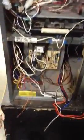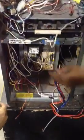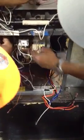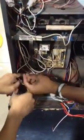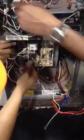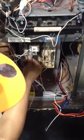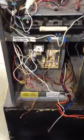While we're still dealing with 110 volts, remember on a call for heat the inducer is going to come on first. So we have that two-pin connection — trace the wires back down from the inducer motor and you should see a two-pin connection down here on your board, and you're going to plug it right in. One of the wires goes to that inducer; the other wire off that pin connection goes to your igniter. You can't put it in the wrong way — the pin connection only allows you to put it in the correct way.